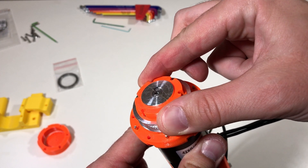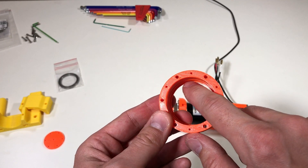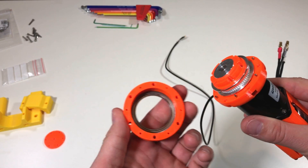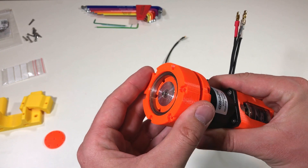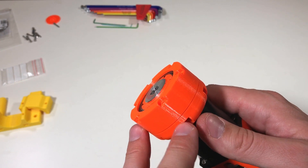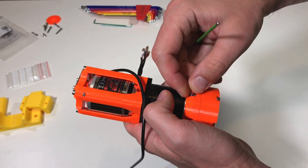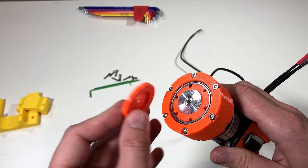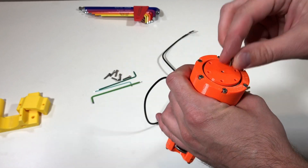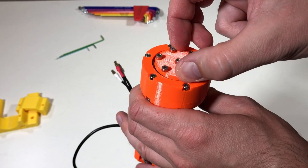So with this pulley it's easier to feel the backlash on this gearbox. Now in this piece I need to install the bearing over here — and this is my bearing. So now this piece goes on top over here and we should align the holes for the screws and for the dowel pins. Now I can fix this part with the screws. I have this cover which goes on top and it's fixed with all the screws. And the main assembly is ready, and it looks quite nice.